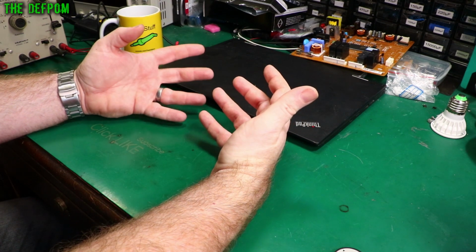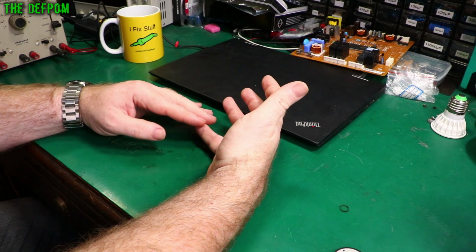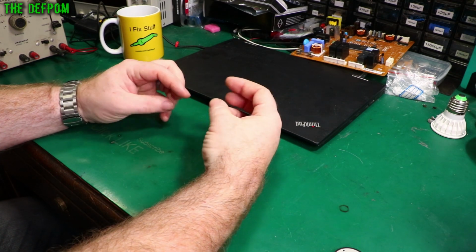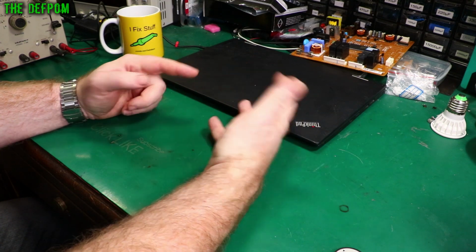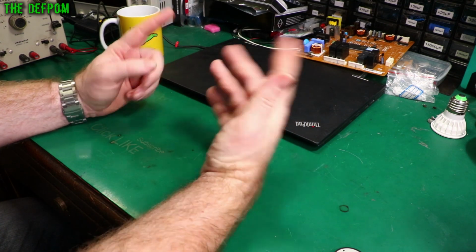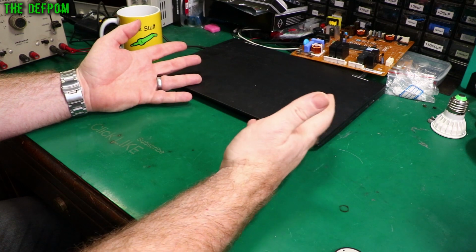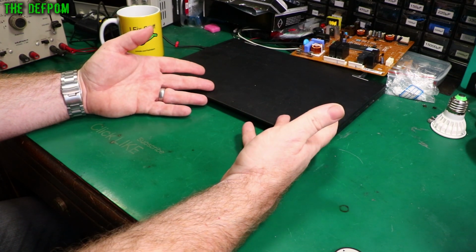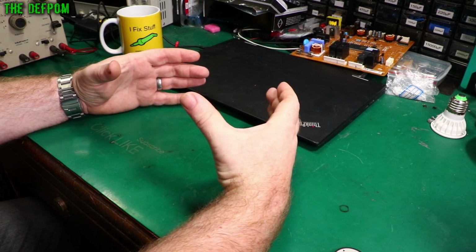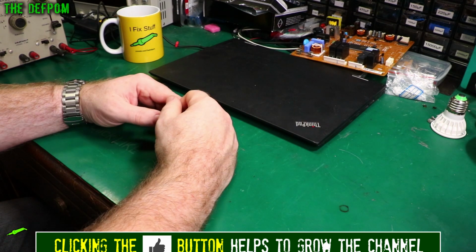It depends on what you're looking at targeting. If you're looking at SMD stuff or through-hole stuff. If you're not worried about through-hole because that's old technology, and you're only worried about surface mount stuff, it gets a lot easier because you can use sample books. And if you're going to use a lot of particular values, say if you're going to do a lot of design, you're going to be using, say, 100 nanofarad caps, lots of those, buy them in a roll. Buy a whole spool of them. You'll use them all eventually.